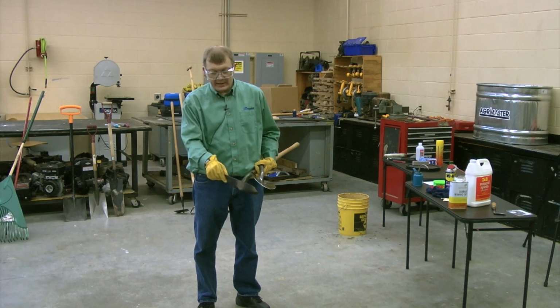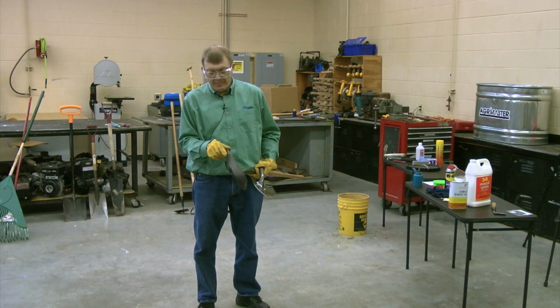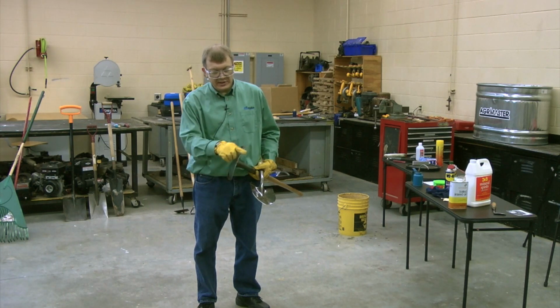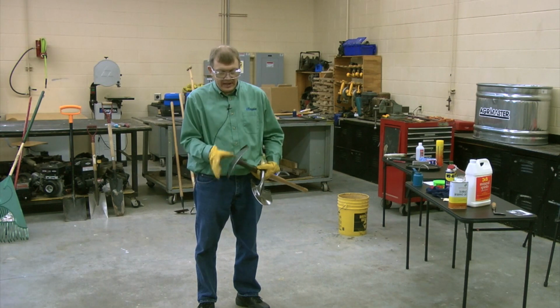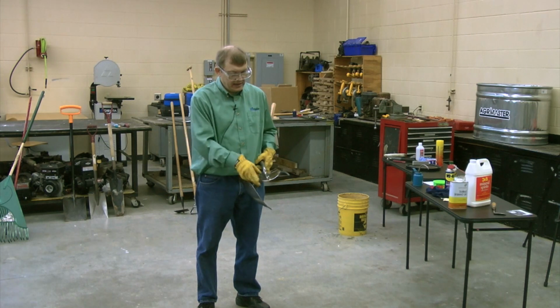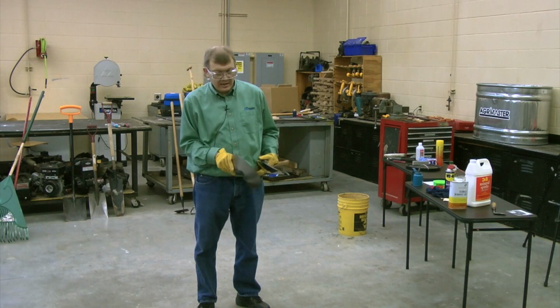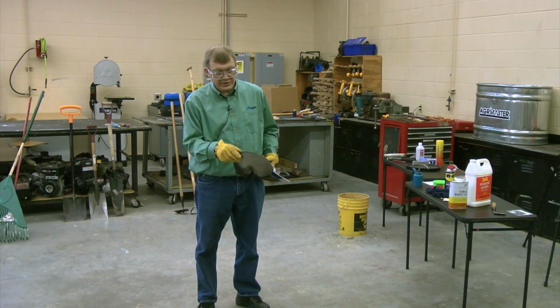But I started to do it on the outside because if you use a power grinder or a bench grinder to set that original edge, you're going to have to do it on the outside because you can't get it on the inside. The only way you can get the inside edge is do it with a file. So that may change how you do what you do.